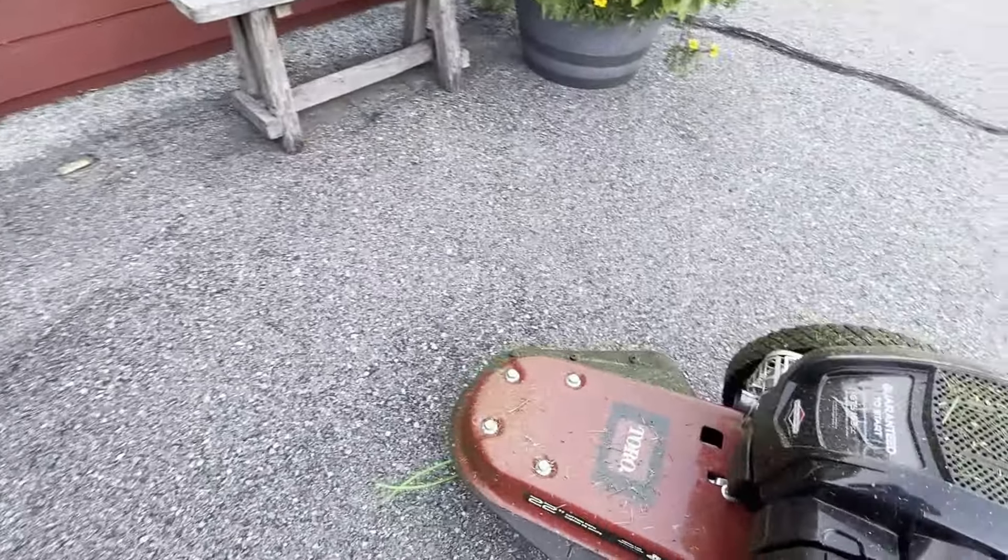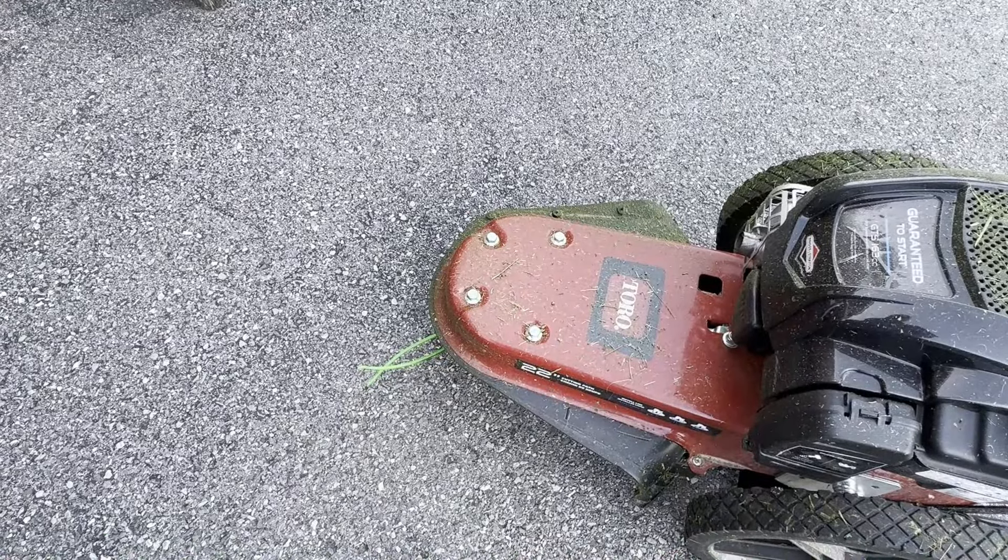It turns out I probably could have done it myself. What this does is keep the tension on the belt. Probably what happened is that when I started using it back in early spring, it was still pretty cold — the belt had maybe shrunk a bit from sitting out in the cold barn and the tension was off. They adjusted the tension and it came back to life, full power, no problems whatsoever. So keep that in mind: if the front rotor starts to slow down and stops under resistance, the tension is probably off and you just need to do that adjustment.